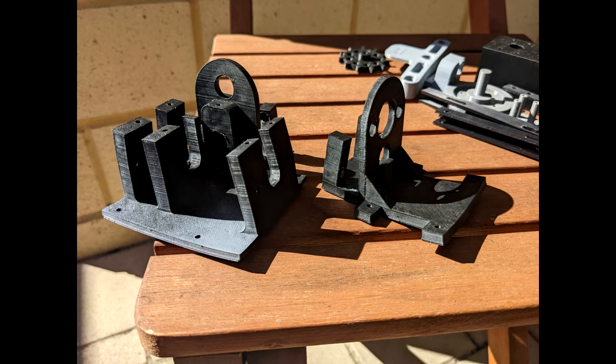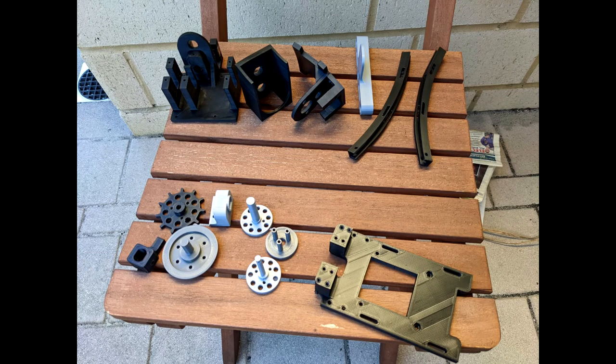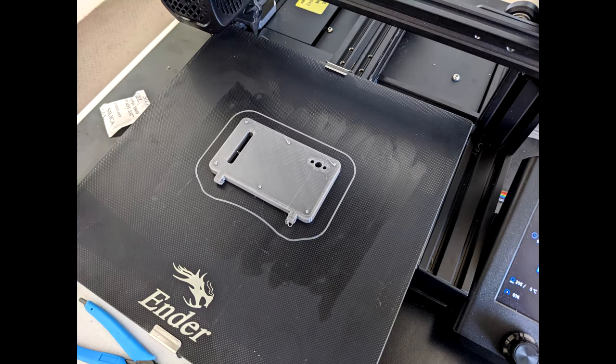To be honest, in this 3D printing game, I really don't want to worry that my prints are going to melt. So I'm happy to keep PLA+ as my prototype filament. At that point I moved on to: what other filaments do I have available that I can print at low cost, accessible for my printer without causing too much trouble, and that won't melt in the sun? That's when I moved on to a filament called PETG. This is the stuff they make plastic bottles out of — soda bottles, water bottles — and they hold up really well in the sun, as you've probably experienced.